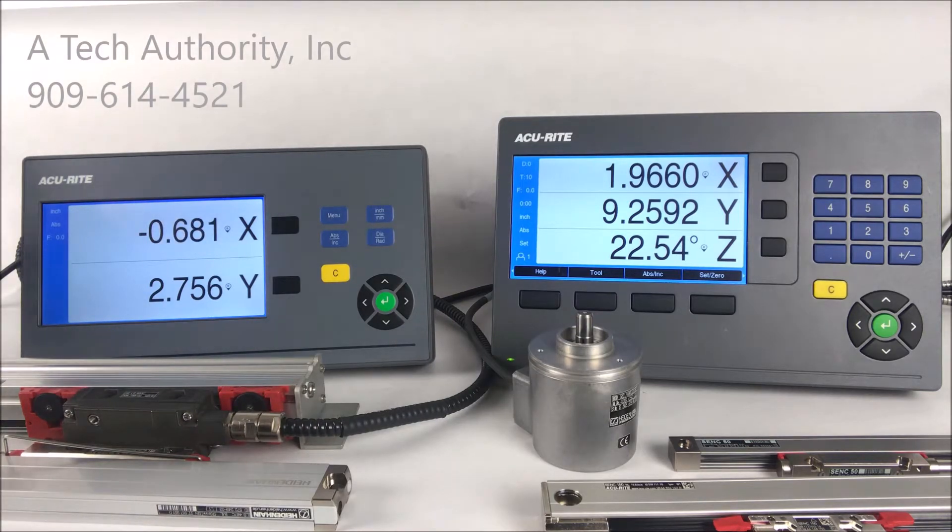My setup here is quite unique. I have two Heidenhain linear scales plugging into this Accurite readout. You might be thinking this is a trick, but trust me — this hybrid setup works with high-accuracy Heidenhain scales into the economical DRO100 readout by Accurite. This technology breakthrough is due to the new inline signal adapter, the Meridian signal adapter, which was just released, giving us many more options to help our customers.